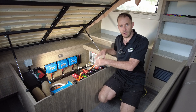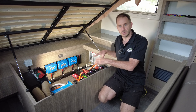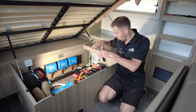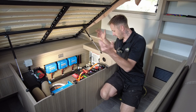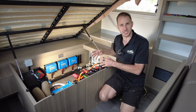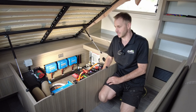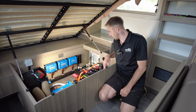560 amp hours of PowerPool Scouts — these are the custom-made lithium batteries from over in Victoria from Paul. These have a continual discharge of 250 amps per battery. So one battery can support the full load of this inverter should one battery fail or if a battery is pulled out — it's a redundancy thing. Both batteries can support this inverter quite easily from 0% to 100% all day, every day.